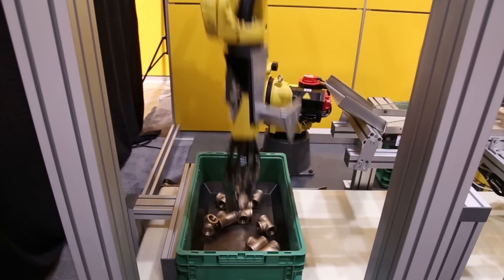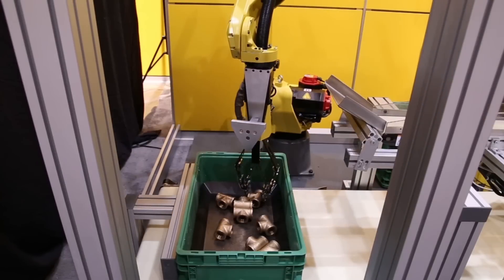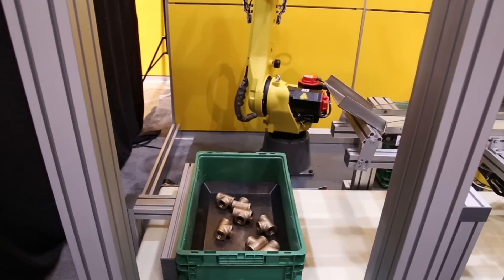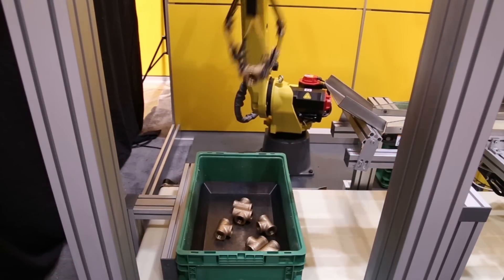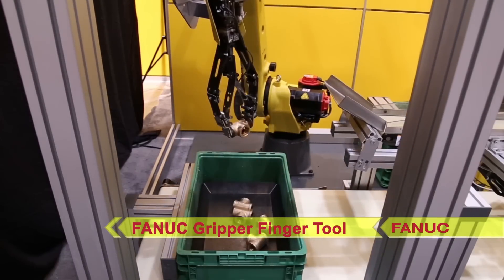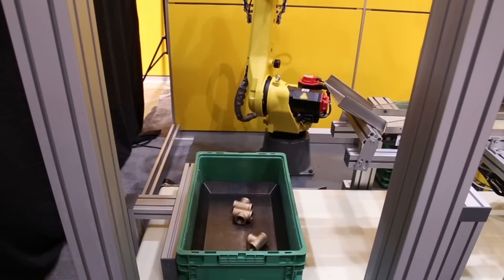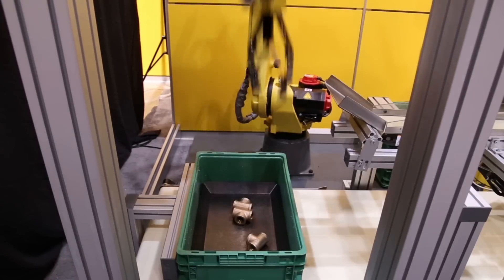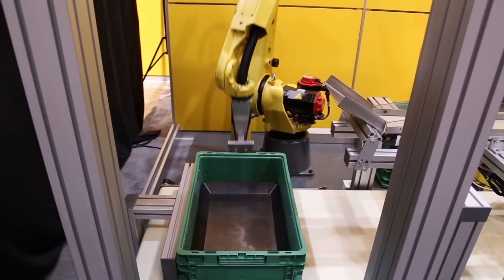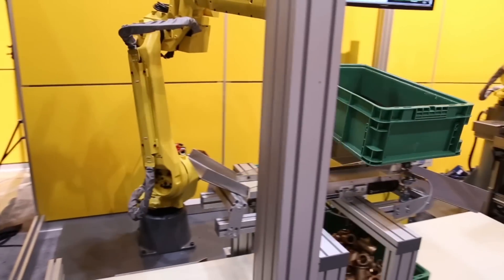The parts in this system are non-ferrous, so where magnetic and vacuum grippers would fail to grip these parts, FANUC's bin picking gripper can firmly grip the parts no matter the orientation. In addition, this system uses FANUC iR Vision's new gripper finger tool to analyze a 3D point cloud created by the 3D area sensor to locate areas where the gripper fingers will fit to grip a single part. Once the bin is emptied, the robot picks the empty bin and sets it aside while the bin full of parts moves on a conveyor to the pick position beneath the 3DA1300 area sensor and the cycle repeats.